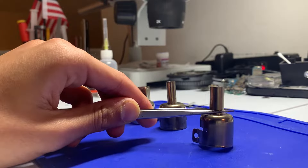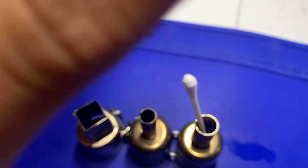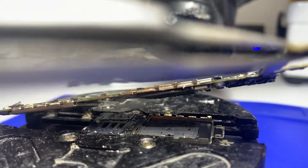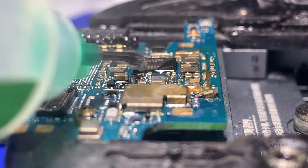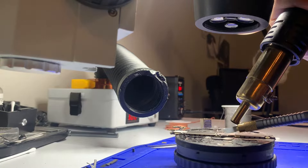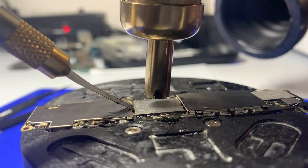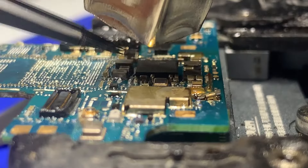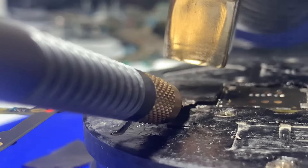The machine comes with three different tips: one small, one medium, and a pretty big square for general repairs like iPhones. It's been working for a year — I do IC chips, I do Tigris, NAND, Hydra, anything else you need to do. Here it is doing a NAND — you can see it's not struggling at all. Here it is doing a little chip, here's it doing a capacitor, here it is desoldering a CPU.